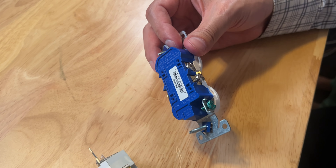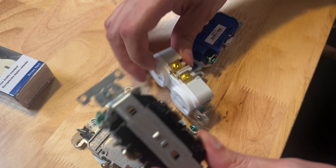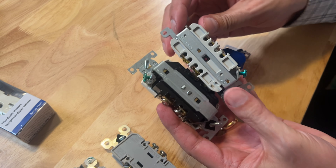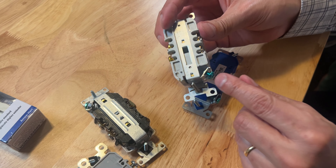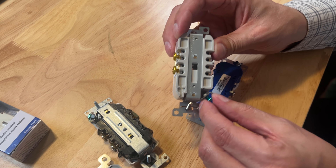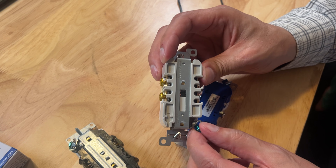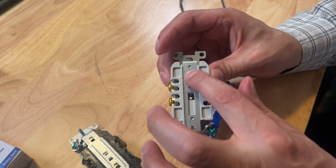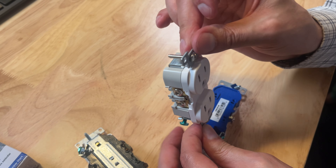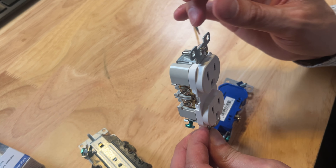Let's look at some more expensive outlets. These are more expensive outlets. They have a bonding clamp on the whole back side of the outlet. This is only a few dollars more for a quality outlet. When you ground to the ground side here, it actually grounds the entire metal housing — both tabs — and you screw it into the box. The entire box would become grounded if it's a metal box.